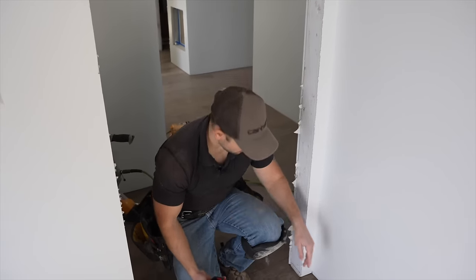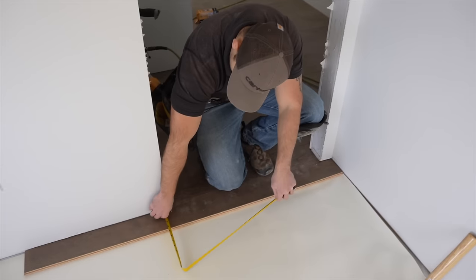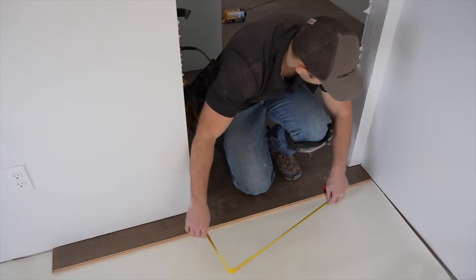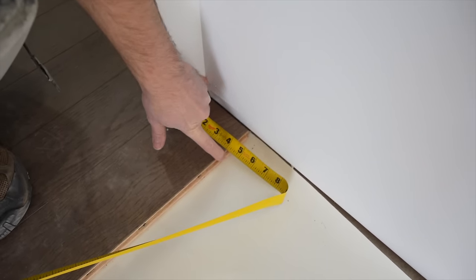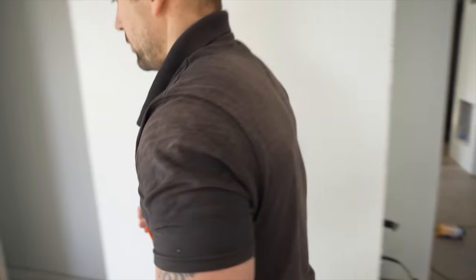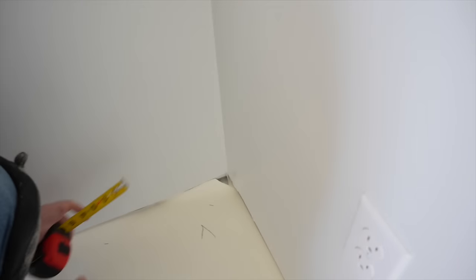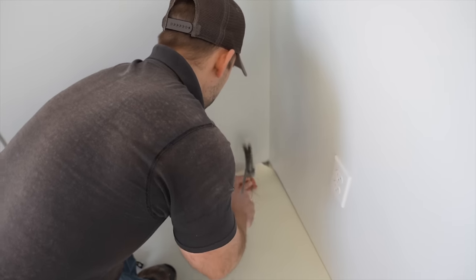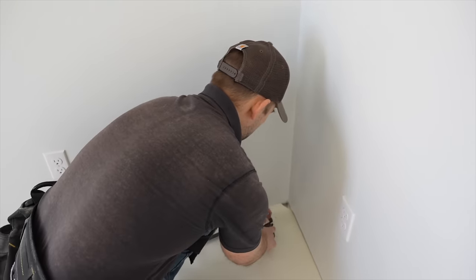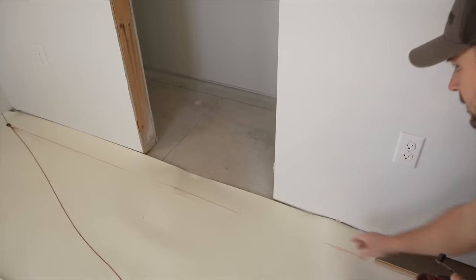Right along the wall we'll have to drill and screw it down just like the other pieces. To continue into this room, we need to measure up off the wall and chalk a line from the outside of the tongue clear down across the room. We got four and about three-eighths on both sides of the opening. Come down to this side of the room and measure off the drywall four and three-eighths, put a mark, place a nail on that mark, and chalk a straight line down to the first piece of hardwood flooring. That's our reference line to continue the run.